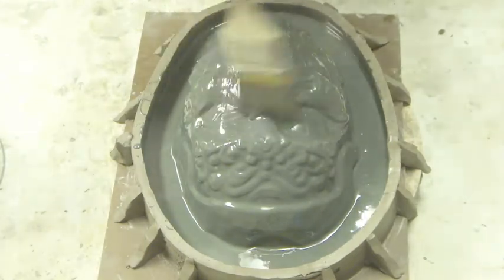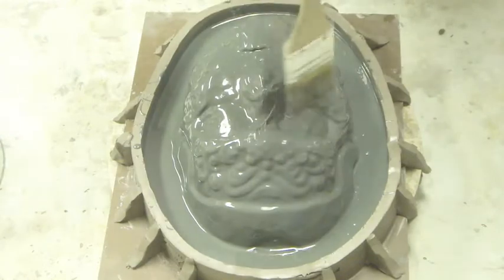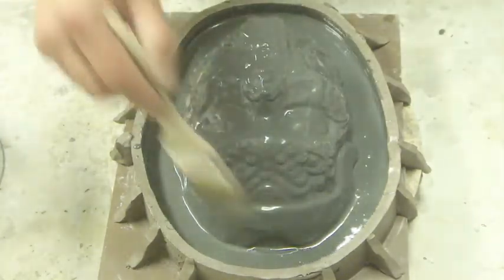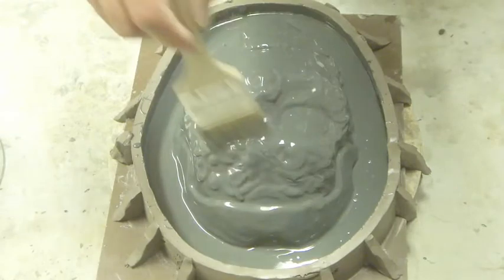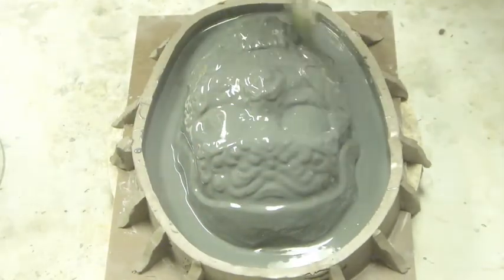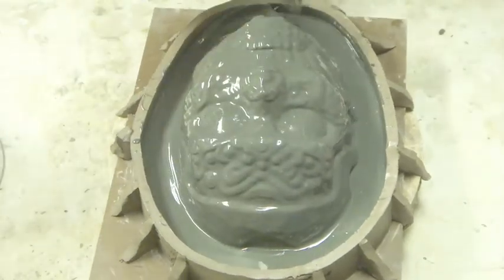If you're wanting to just have a one part 1630, just box it up, pour the stuff in. Very simple, just like the silicone. But typically, if you have a hard mold, like 1630 UltraCal fiberglass, you'll be pulling something soft out of it, something like silicone, something like latex, or a soft urethane, some kind of rubber.